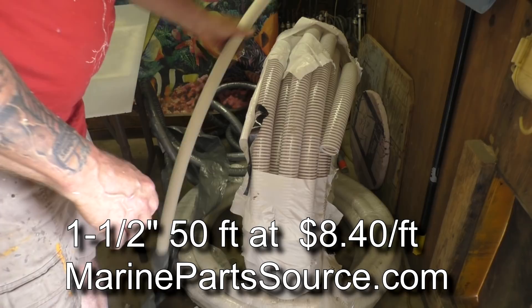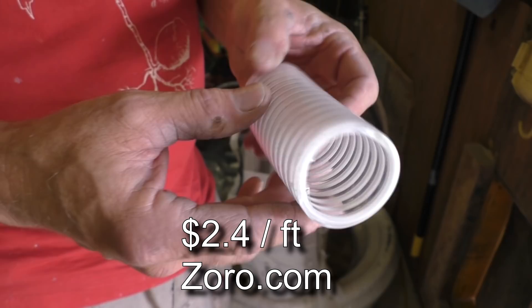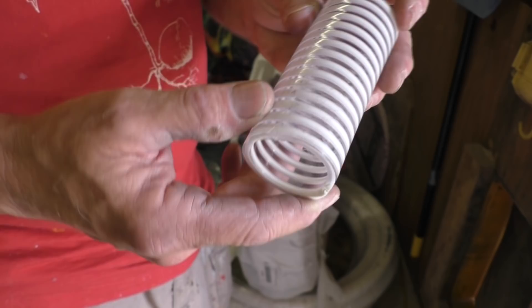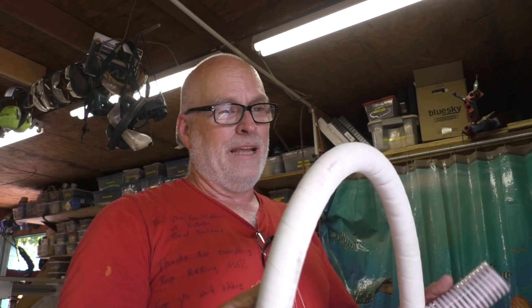When it's not going to hold sewage, I'm going to use just PVC — this is a reinforced core hose. It's good stuff too, but they tell you it's only about six months before you can start smelling the sewage sitting inside of it. So if you had a system that flushed out all the sewage you wouldn't have a problem, but that's not our system. We're going to have a check valve holding it in the line. If you use PVC hard pipe you're fine; it's just this flexible stuff that has a permeable layer. If I was being really cheap, I would buy a lot less of the expensive flexible stuff and put hard PVC pipe in, using just as little of this as I need to get around tight spots. You'd have more fittings but you'd probably come out a little cheaper.